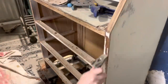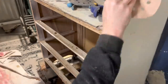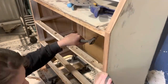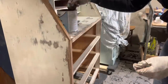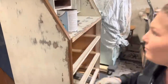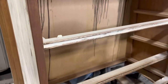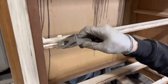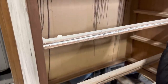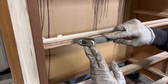I finally remembered I have this stripping tool sent to me by Emily — I always forget about this thing and it is just incredible. It made such quick work of this paint. I would literally just scrape the paint off in two seconds, and then I could go in and hand sand all these front little trim pieces, because those I'm going to stain, and then the side panels I'll do black. So it's all getting broken up with this two-tone look. I'm opting to stain first, and I decided later on that I wanted to keep these wood. So same thing — I'm going to scrape these, stain them, and then seal them. That way when I go in with the black paint, it doesn't contaminate them.